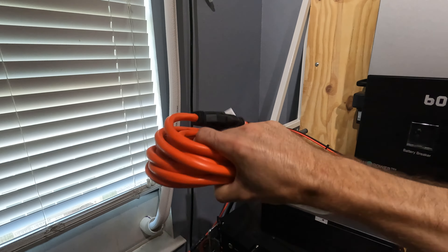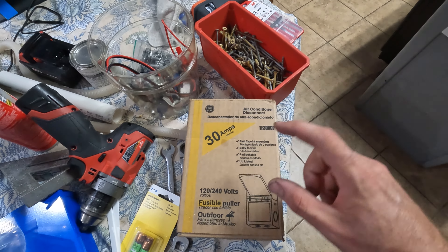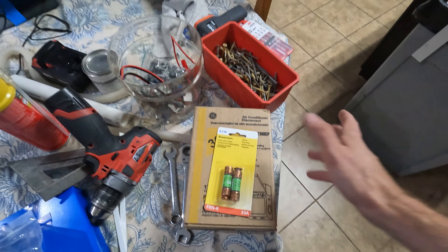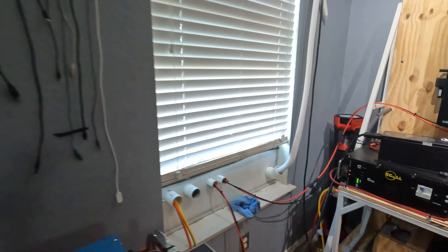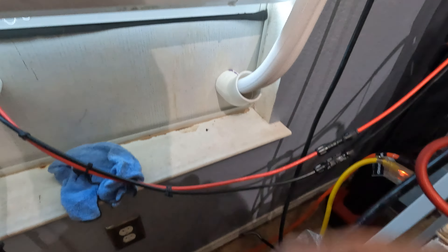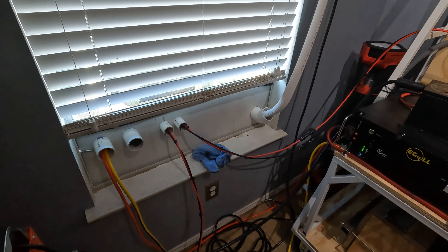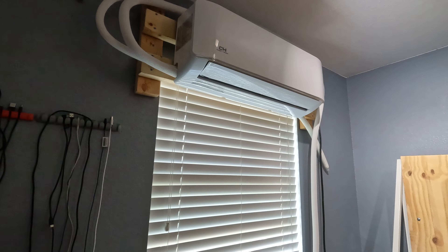My favorite thing to use to power my mini splits is always a 12-gauge extension cord that I cut up. I've started recommending putting a disconnect on all my mini splits — you're supposed to do that anyway. I have this 30-amp disconnect with 20-amp fuse. Power is going to come from the solar generator to the disconnect, then to the AC unit itself — that adds redundancy for safety, and if I need to service it I can disconnect it and know it's completely shut off. I'm going to drill another hole because it's already a little tight with the half-inch and quarter-inch line set, and run the rest of the cabling through. Once I have everything threaded through, we're going to torque the line set down and start the vacuum process.